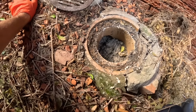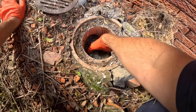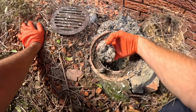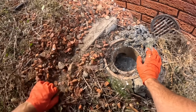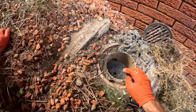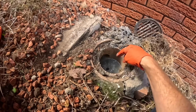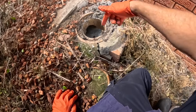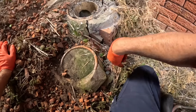Block drain. Oh, that's grease. Full of grease. Up towards there as well. I don't know what this is. You know what it is. It's an old grease trap, I think. So kitchen comes along, goes through the grease trap, gets sieved out all the grease, then it moves its way into the gully here. Comes out of the gully, then drops straight down this way.